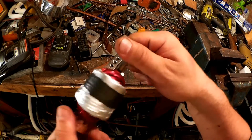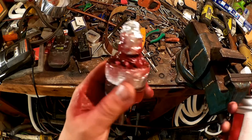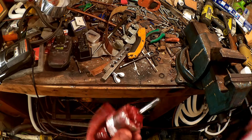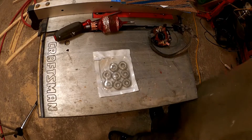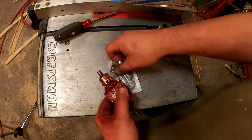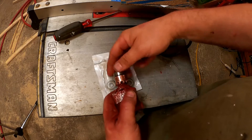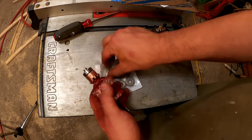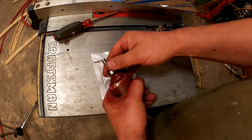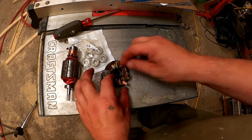Having masked off the middle of this with some aluminum foil, I'll just replace the missing enamel there. I've got a nice new eight-pack of skate bearings here, but as you saw, this shaft measured slightly undersized, so these will press on by hand — just fit tightly enough.